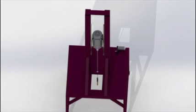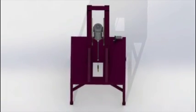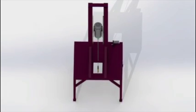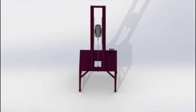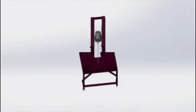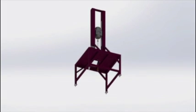A stopper will be added to the bottom of the elevator as an additional safety feature in case of drawworks failure. We will use a 2 horsepower 220 volt DC motor as the top drive. The drawworks system is operated by a 12 volt DC motor. Air is used as the drilling fluid, which provides the required cooling and hole cleaning while reducing chip hold down to allow more brittle failure and increased drilling efficiency.